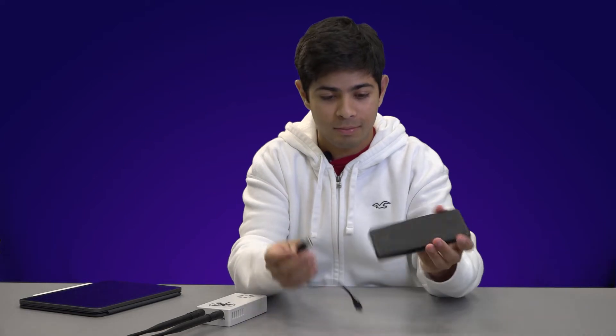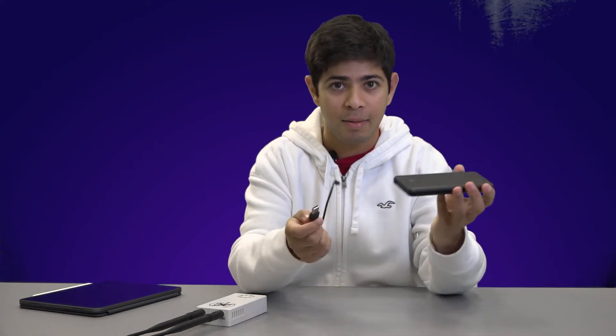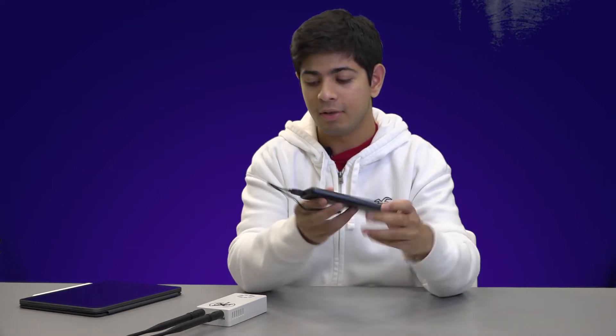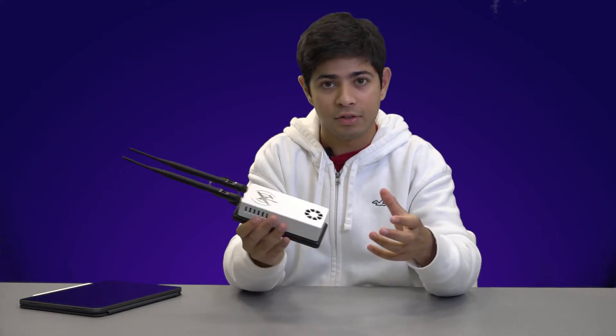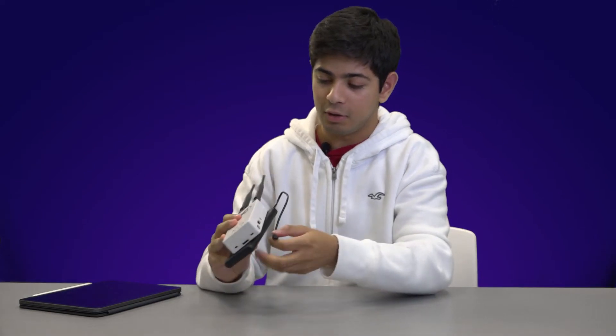You have to have a decently powerful battery bank or power source to make sure it gets enough current. Otherwise, it will act inconsistently and may not get exactly what you want. What I use is this Anker power bank from Amazon — one of those things you use to charge your phone or iPad. You just plug in a micro-USB cable and attach it to the bottom using a rubber band, or there are certain mounts offered as well. You just plug the USB cable into the micro-USB port on the Raspberry Pi.